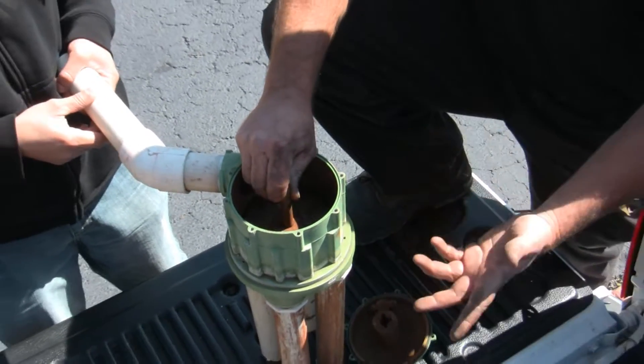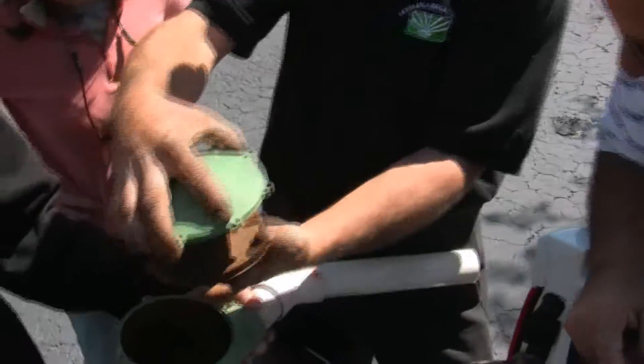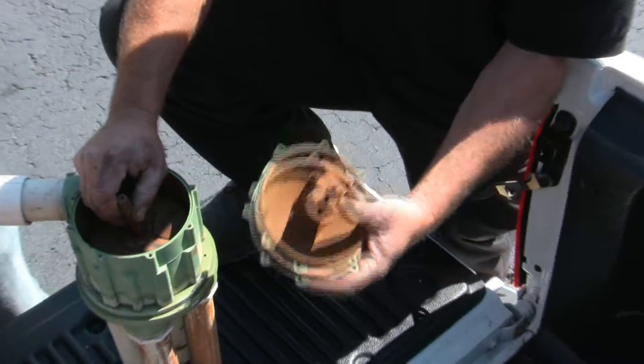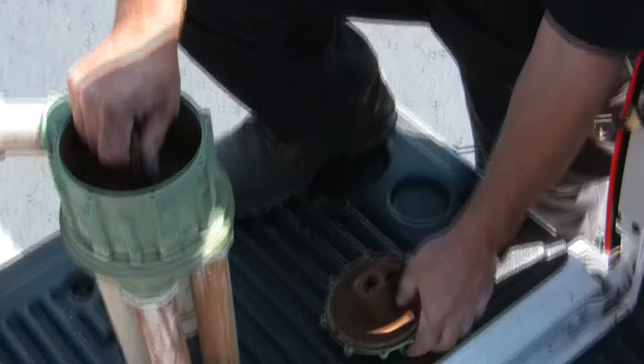When the pump or the city water is turned off, it springs up and there's a cam inside the top that it rides on. When the water pushes down, it twists automatically — it turns. Then it pops back up and rides up and down on that cam. So the next time it comes on, it spins to the next zone and pushes back down for that zone.